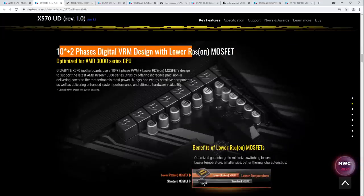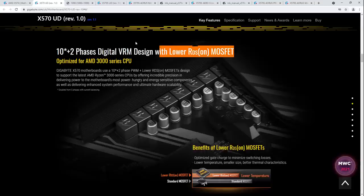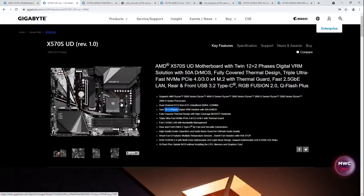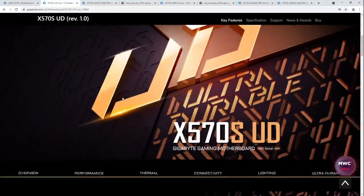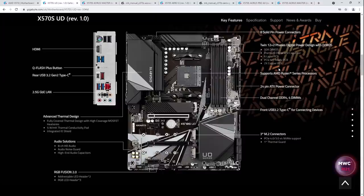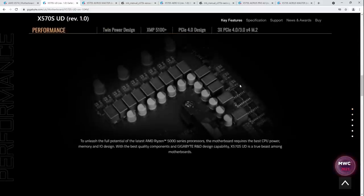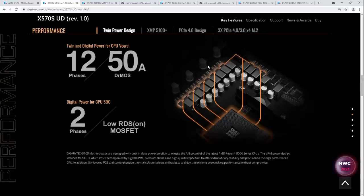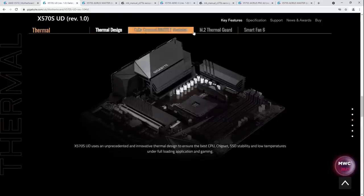We've got the passive chipset heatsink instead of the old active one. This should have significantly better memory overclocking capabilities than its predecessor, run somewhat cooler, and has a bigger VRM heatsink overhanging the IO. This is a 12+2 phase on 50-amp power stages. The old one was actually on discrete MOSFETs — half of them were on the back — and it ran pretty hot, though it wasn't a complete catastrophe. So now you have modern power stages instead of MOSFETs.